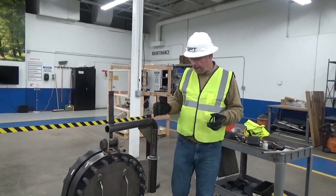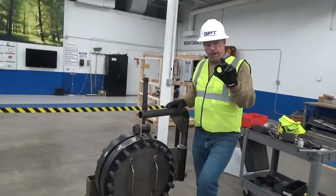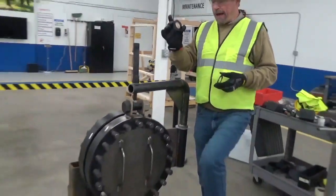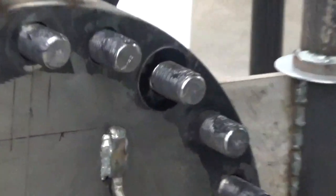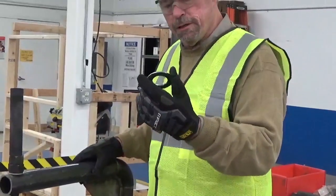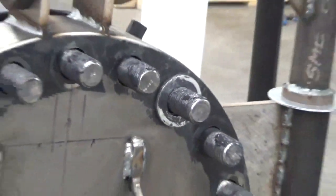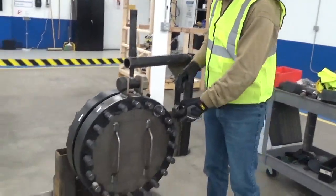Okay, now we've got every stud lubricated with isolating lubricant, Pico lube. We will now install isolating washers on this side. So again, the non-metallic washer would go first, or again, I recommend Diamond Hide. You can put both on at the same time. Or if you're using G10 and CPS, or G10 and stainless steel, or G11 and stainless steel, you put the metallic washer on last, followed by the nuts. Again, the flat side of the nut would go towards that metal washer.